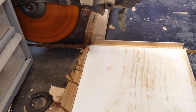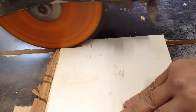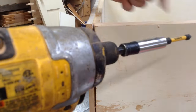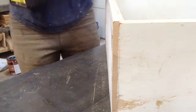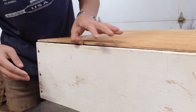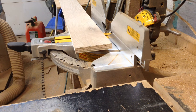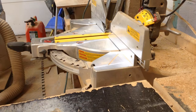I like to build all of my cabinetry with dados and rabbets. I find it's easier for them to glue up, they stay more true, and it's a more structural way to do it. For something like this, pocket hole screws would be more than fine, but I already had my dado stack set up in my radial arm saw so it was easy. All of this is based off the dimensions — this is about two feet wide, so my bottom piece is two feet wide. I came in the thickness of my shelving for that dado and then I could add the backers. This is a big open cubby for the back, which will mostly be covered by the two side cubbies I'm making now. The door is off-center so one will stick out more than the other — it's not a construction mishap, the door is just not centered in the closet.